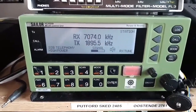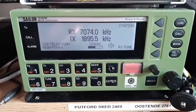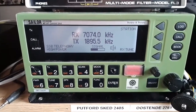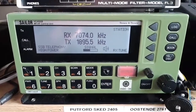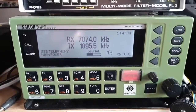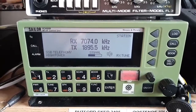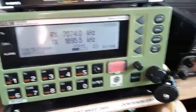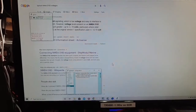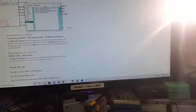Success at last — I've been struggling to get a GPS feed into this thing so it didn't keep coming up with alarms. Obviously the position not moving isn't a big deal, but I wanted the time and position in there, fed by NMEA 0183 standard. I was struggling to get this done, but I have a solution. After my Simrad GPS decided to go pear-shaped, the solution is this little program called GPS Feed — it's a simulator.